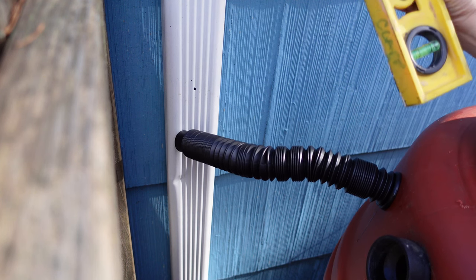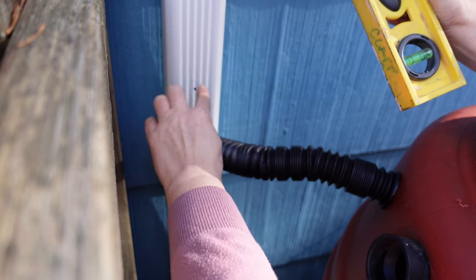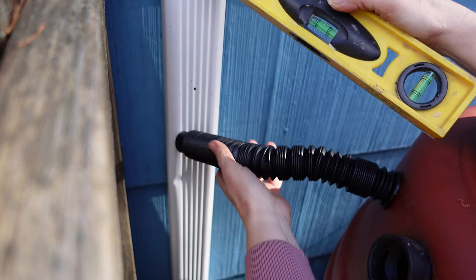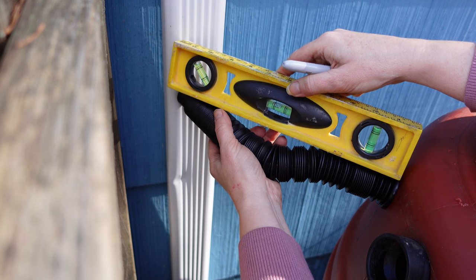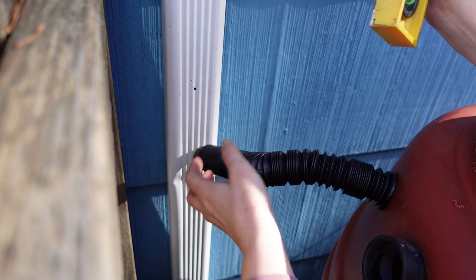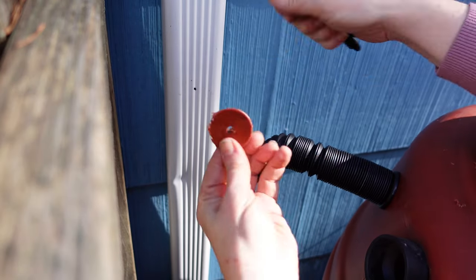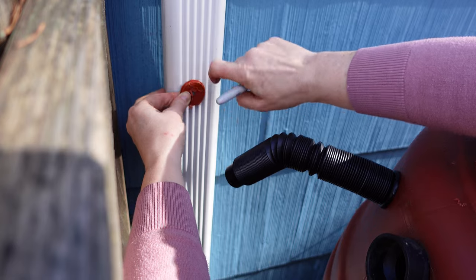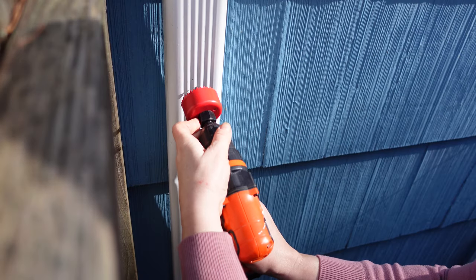For my open-topped barrel, the hose is supposed to be essentially level or just the tiniest bit above level into the three-inch side of my downspout. Rather than measuring, I just set my level on there, and you can see the little bubble is showing level, and I made a mark where that was. To find the center of that hole, where I'm supposed to drill, I actually took the plug I drilled out and used it as my template — put the edge on there, took my Sharpie, and put a dot in the center. Now I know that's the center. That's where I'm supposed to drill. Wear safety goggles.